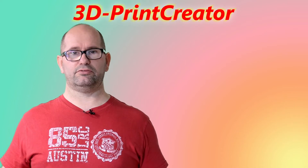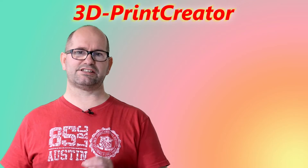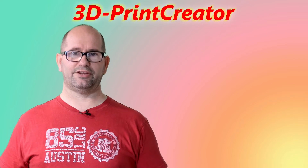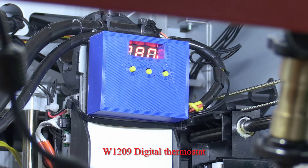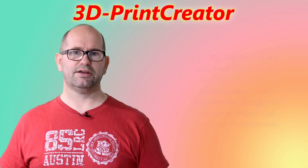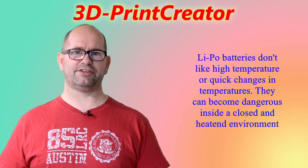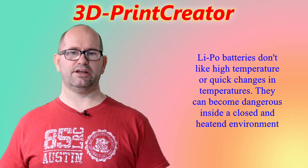Another reason can be to discuss things — you maybe want to have a printer building something and you want to see exactly how it's doing that and show that on the internet. There are also some things you should consider. If you have a printer like mine, which has a closed environment, the temperatures inside can rise significantly. Inside my printer when printing ABS, it can become about 50 to 55 degrees centigrade. This temperature is fairly high, and if you run a camera with lithium polymer batteries — lipos — those batteries can have a problem with this high temperature and eventually they can even explode. So you don't want a camera with lipo batteries inside your printer.